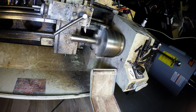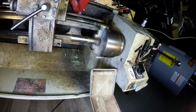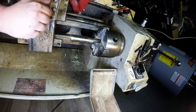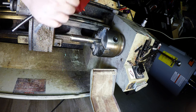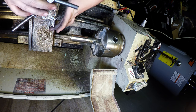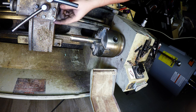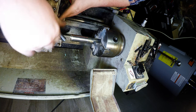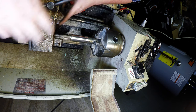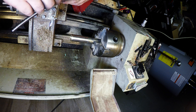And then put where I'm gonna part it. My parting tool's a piece of shit, so... No. Turn a groove on where I want the actual bottom to be, about down here somewhere. Again, doesn't really matter, so I don't have to be super critical. I know the bore ends about here, which gives me plenty of room to play with.